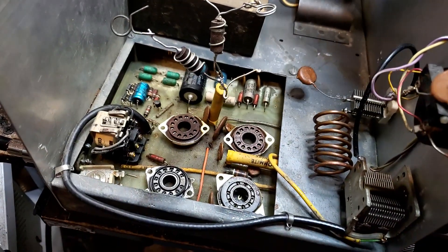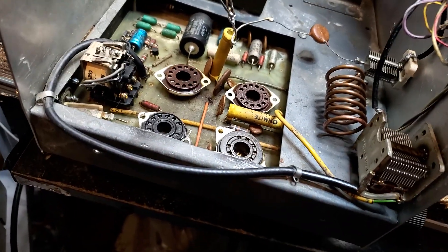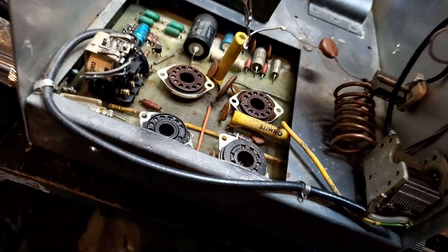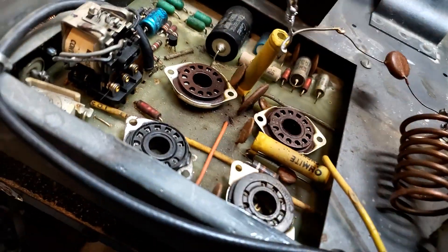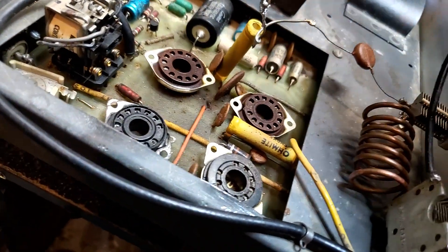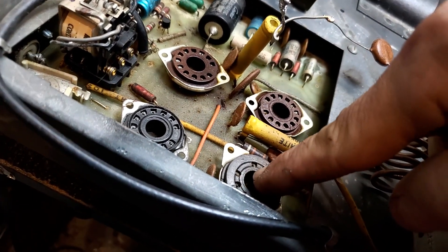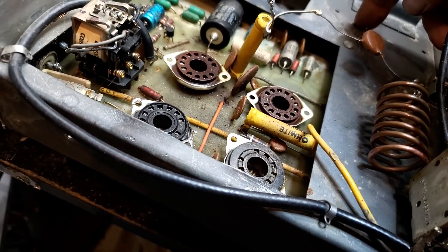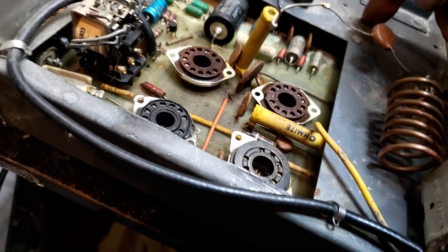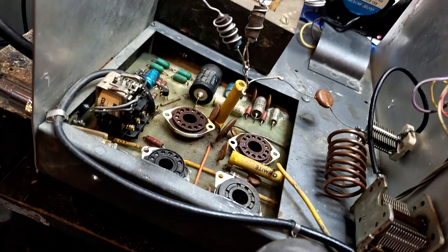After all said and done, I'm going to call the customer in the morning — it's late, I've been playing with this thing all day. I have an L-bracket with one of these eight-pin octals, and keeping in mind that this transformer alone drove three tubes and gave us a nice 400 watts, I'm going to rewire this octal and add another tube over here. What was supposed to be a three-tube that somebody tried to turn into a four-tube, I'm now going to add a transformer and make it a five-tube.